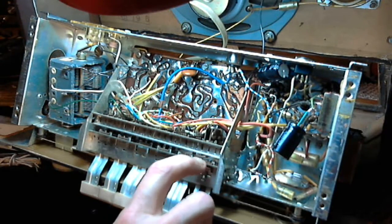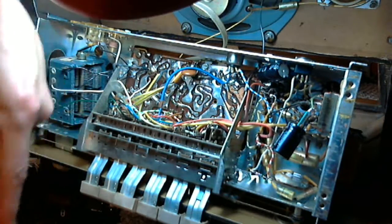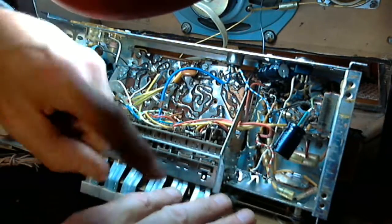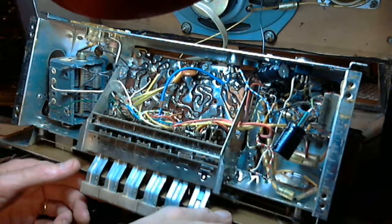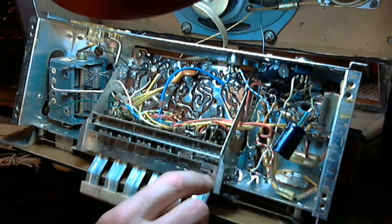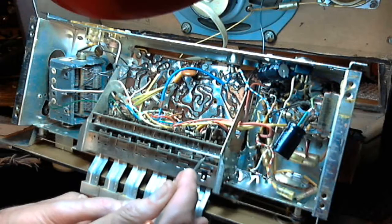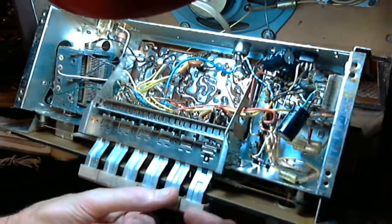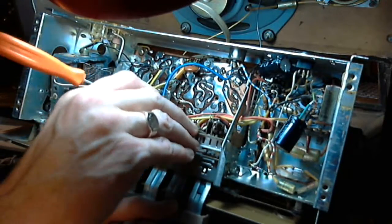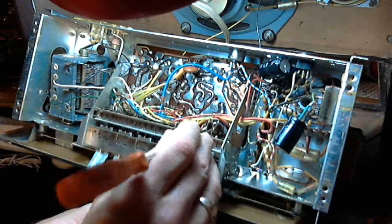There's a sliding plate that moves with this on-off switch, and the sliding plate is coupled into the switch with a link that comes down. So here's the moving plate, the link comes in, and the plate moves the link back and forth, and the link is missing. So the plate is moving, there's nothing at all activating the switch. Now, could it be the link is simply dislodged from its proper spot? I see something in there. There's the link, and it's way out of place here.